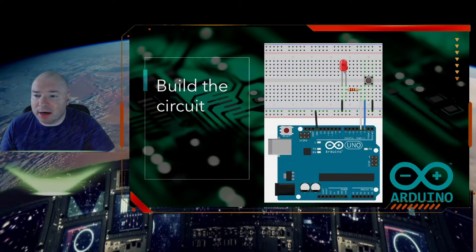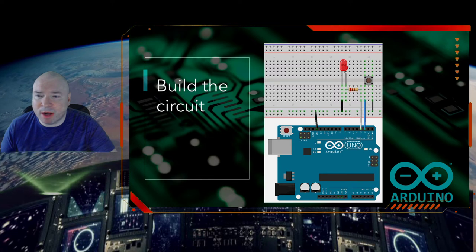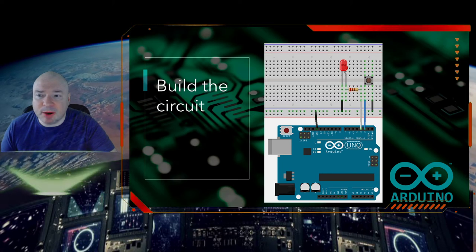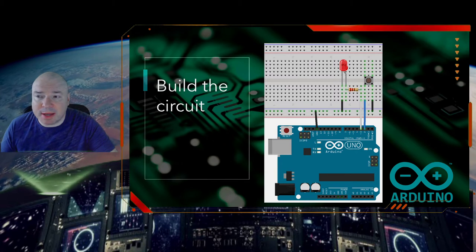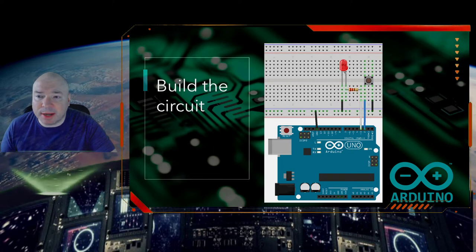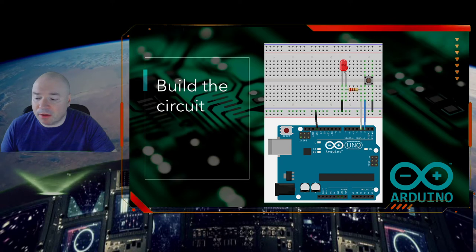So let's look again at our diagram here. This is the actual circuit. And in our circuit, there's a couple things that are a little bit new. First, we have these black wires. These three black wires are ground. And I'm taking advantage of this bar right here. Now, when I say bar, I mean bar because they're all connected horizontally. Now, remember, these are connected vertically, and there's a gap between these, and these are connected vertically. You'll notice the button straddles these two sides because this half of the button is separate from this half of the button. So we could actually be controlling another thing over here on this side. But for right now, we're only using one side of this button.